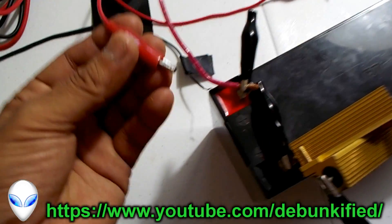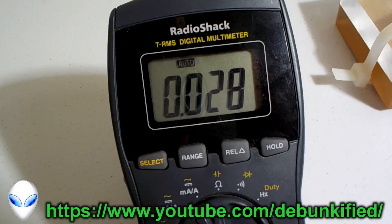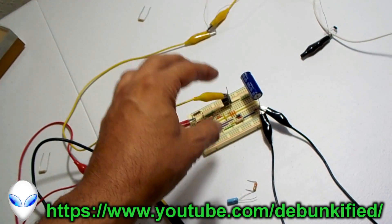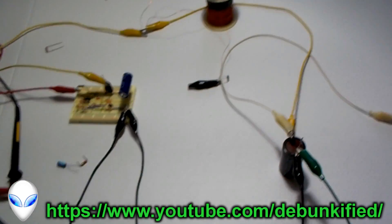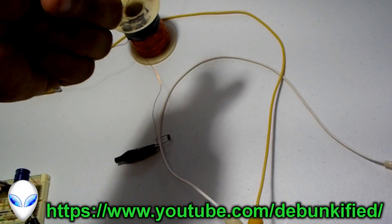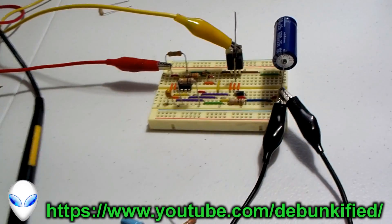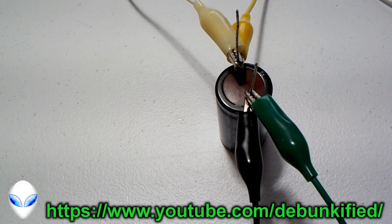Let's turn that on — first we'll show this with a battery. As you can see there's about 28 milliamps flowing from the battery into our switching circuitry. This power is only running the circuitry to do the switching and that's it. I'm bypassing this coil right here — I'm simply taking the negative and pulsing it through the switch back to its own positive, keeping it completely discharged. As you can see there's only six millivolts there, so I assume that's the MOSFET leakage — just six millivolts — and the capacitor is being kept discharged at that level.